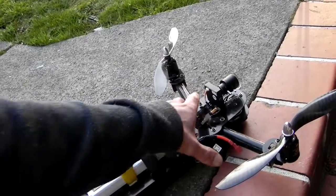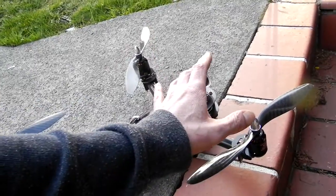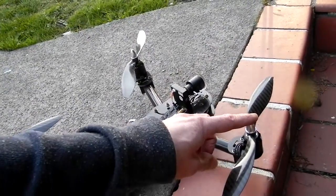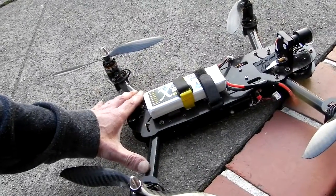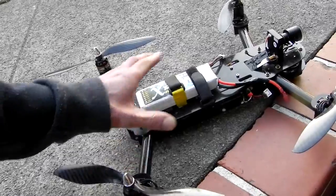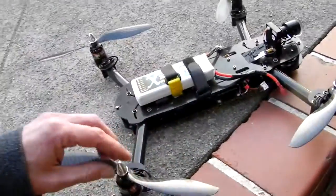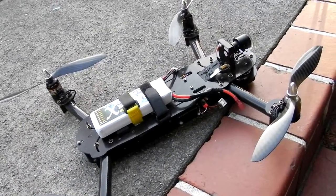All you'll have to do is set up these at full extension forward, and use these two props and motors with their set spacing as your reference point. The rear will have the set spacing with the same lock blocks on each tube, so you'll be able to set your distance by adjusting these arms to the exact same distance from motor to motor, and you'll have your format that way, whichever way you want to set it up.